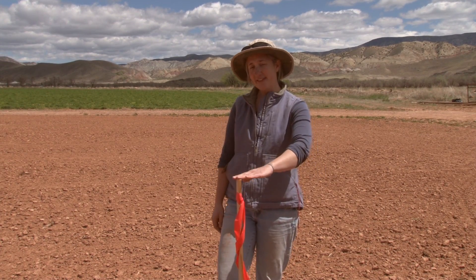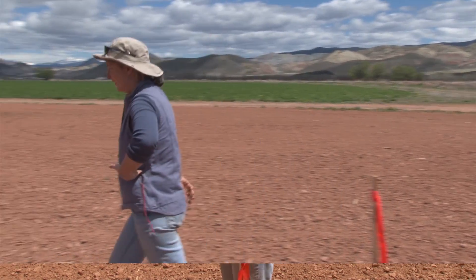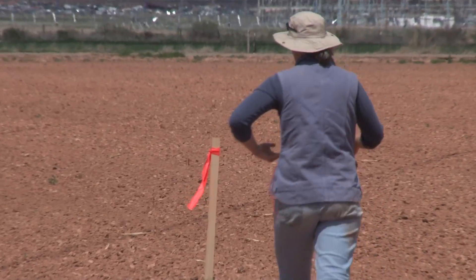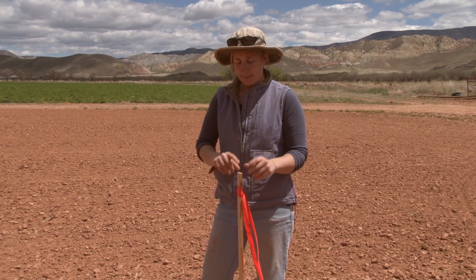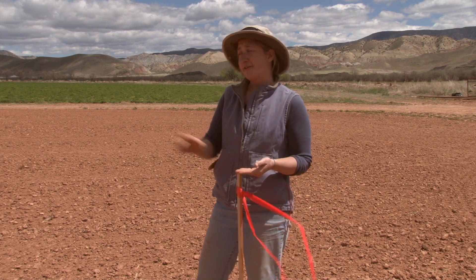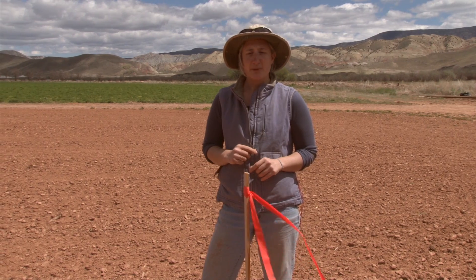It's really nice to have stakes to shoot your slope off of, but sometimes they get knocked around by wildlife or other participants on the site. If a stake is not the exact same height in both locations you'll need to adjust. One way to check: stand right up against the stake, mark a point on your body, walk down to the other stake, and make sure it's about the same height. If not, slightly adjust the angle you're shooting at. Another check is to shoot the slope both directions — I got one percent here, so if the stakes are at the same height I should get one percent shooting back, just positive in one direction and negative the other. If I got one percent one way but five percent the other way, I need to figure out if my stake heights are off or if I need to work on my clinometer method.